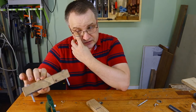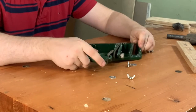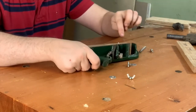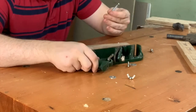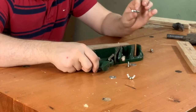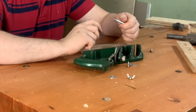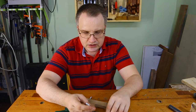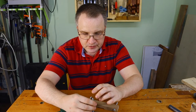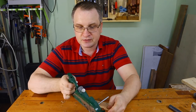Then there's another small piece and some hardware. One of the critical parts I was very afraid about when I started thinking about this is something that will come to this one. I found out that a standard threaded rod actually almost fits into this slide. The thread is actually a little bit different from the standard one I bought, but it's not that much different. I think I used a coarse tap just to tap it a little bit more. Just try to go to the store and play with a few rods you can find there - I think this one is standard, not the Stanley weird thread. That's the most critical part you need to have.